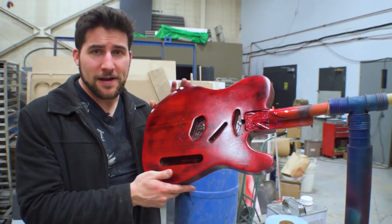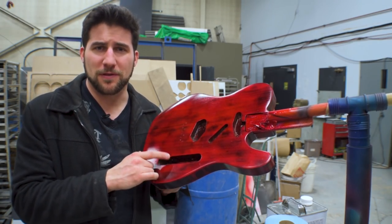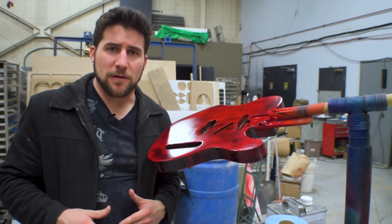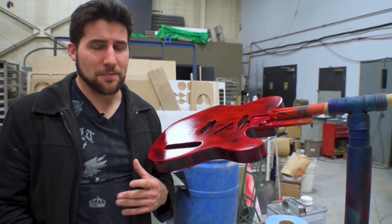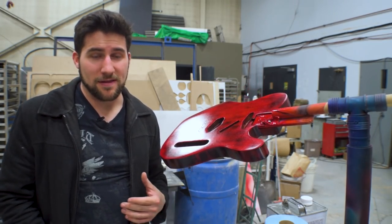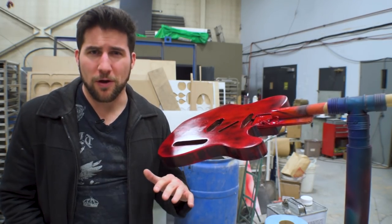This particular guitar was painted exclusively with nitrocellulose. I'll be posting a video about this paint job specifically because I'm pretty happy with it. One nice thing about these lacquers is you can mix dyes into them very easily — any kind of aniline dye, or pigments designed for lacquer. This was a clear lacquer with a candy dye in it that is designed to work on a polyurethane, and it mixes just fine into the lacquer — no problem whatsoever.